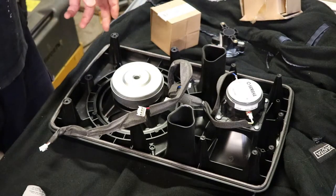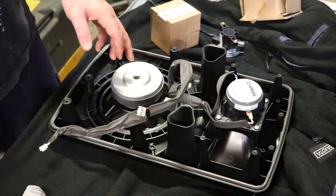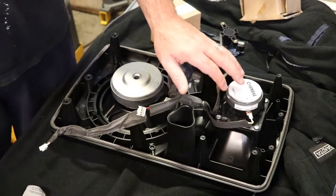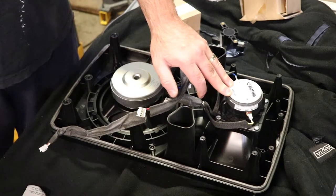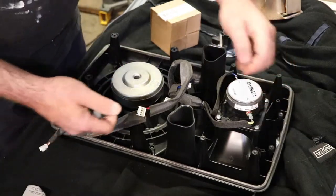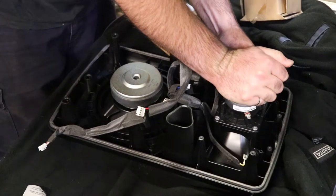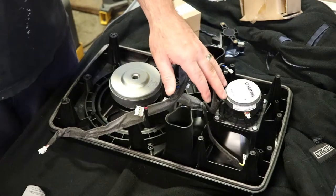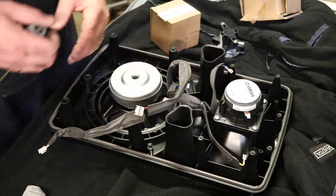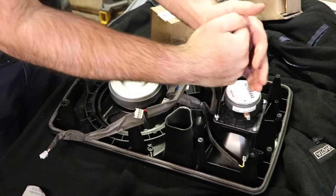When you look at the block diagram for this 400i or 400S system, you'll see there's an SP-EX, which I assume is a speaker equalizer in the system. So it's possible that the mixer fixes the response of the speaker and I don't know what the end result is going to be. I know the compression driver is going to be louder for certain. To take this off, the positive is red or yellow and the negative is blue. When picking a replacement speaker, you can get a ton of different options — you need two M6 screws on a three inch center circle. I might as well just stick with Celestion if Yamaha thought they were good.